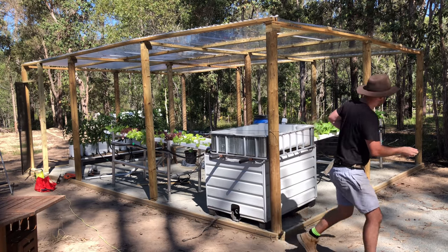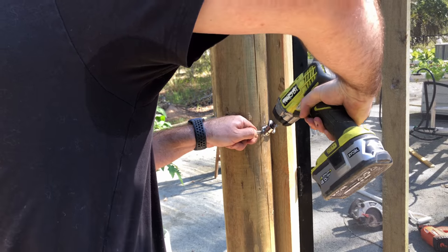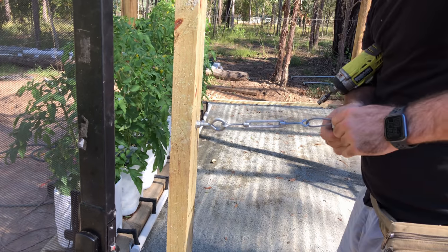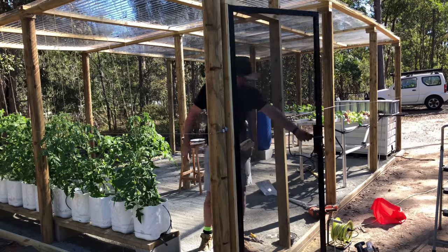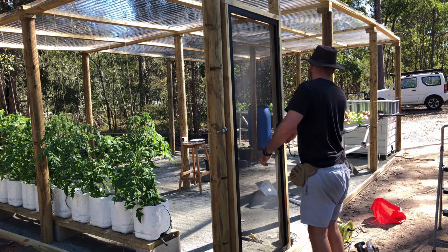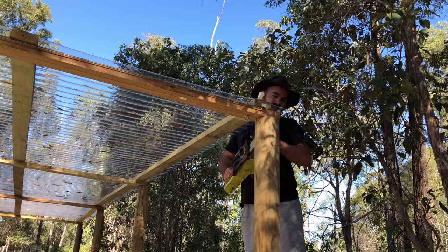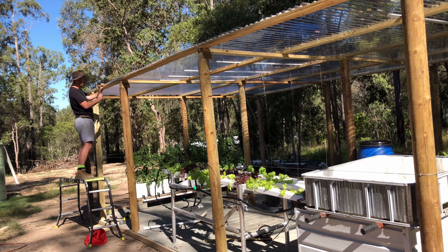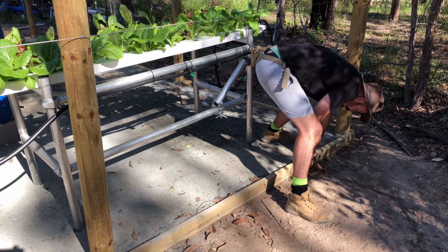To tension the wire I used galvanized turnbuckles, which I attached to the wire with galvanized wire clamps that I tightened in place. I used these clamps to attach the turnbuckles at each end of the wire. The other fixing you can see is a galvanized eyebolt. I used a chainsaw to make the end flat for the guttering, and then it was time to put in the horseshoe nails to hold that wire in place where there are no eyelets, and we can start to attach the shade cloth.